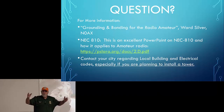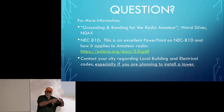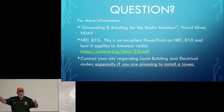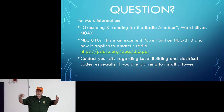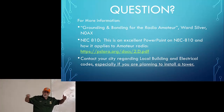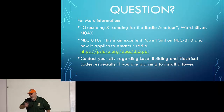Not a lot, a little bit. It's based on the properties of that cable. So it hits the matching device, your transmatch, your ATU. And what does the ATU do? It turns right around, sends power right back up toward the antenna. So that 10 watts that got reflected hits the ATU, minus the little bit that was lost in making that travel down the coax. The ATU turns right around and sends what's left right back to the antenna.